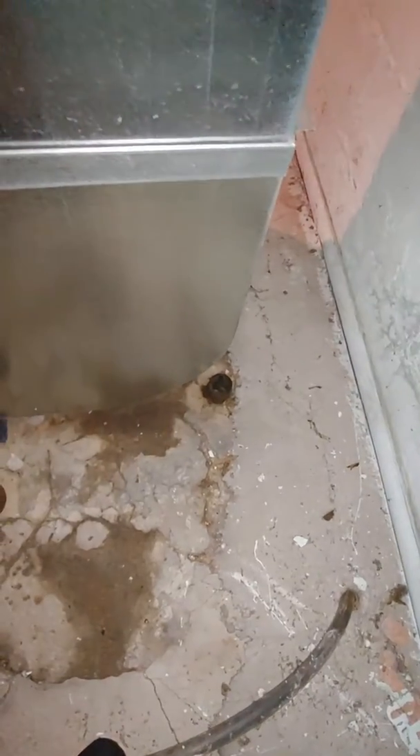New vinyl tube to the drain back there. One thing is the drain is going straight into the ground. I don't know if that would be a route we can go back to. If it isn't, we may have to do a condensate pump — just kind of be aware of that. It's literally just going straight into the ground. There's that drain there. I'm sure we'll be able to figure it out.